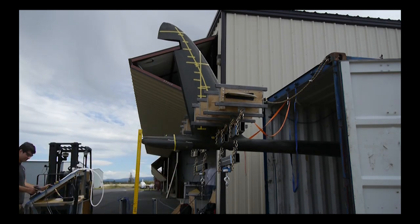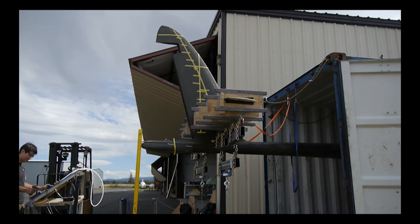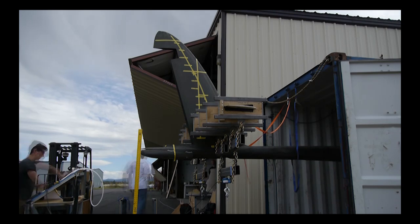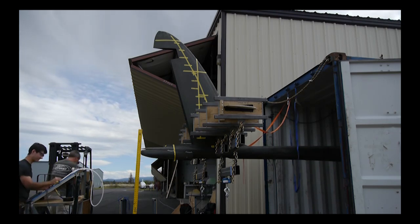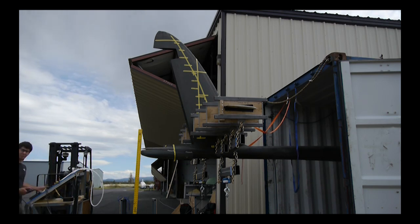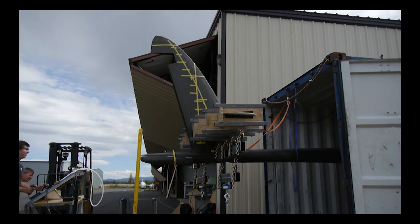This is a later test — we did a lot of testing on the empennage. This is a bigger test of the empennage. You can see that little stick there — next time you do a loop, your plane's bending too. We need thousands of pounds of load just to test these things. Here are views of the tail: unladen, loaded, and then the result. The pressure bulkhead that failed — is that just a flat plate? Substantially yes, though not completely flat. Would it be better if it was domed? Well...